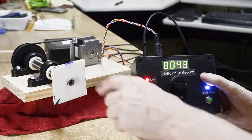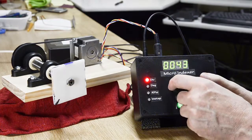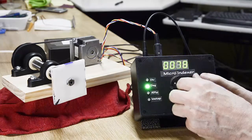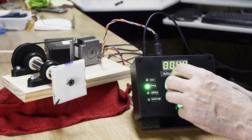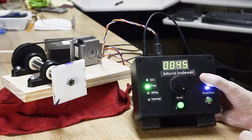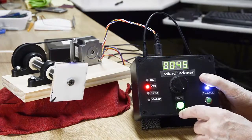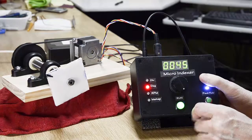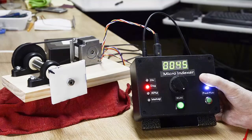If you're cutting a flat surface on a piece of round stock and you want to make four sides on it, you could do that by going to degrees — 90 would give you four. If you want eight sides, you'd turn this down to 45. So you make a cut here, step it, make another cut across, and so on. The motor has to move the part accurately and be able to hold it while a cut is being made, and I believe a smaller motor is plenty for this.